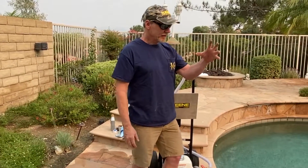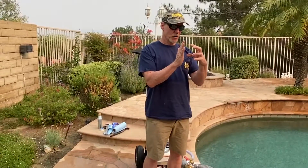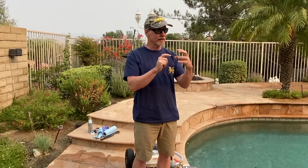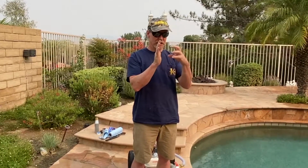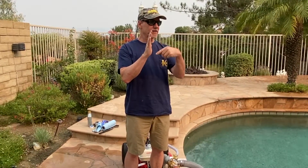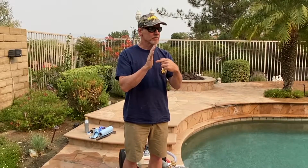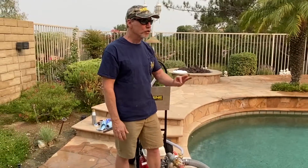See, inside the pump, you've got a back plate and an impeller, right? Well, the seal between the two is called a pump seal, and you have a white, highly polished ceramic surface on the back of the impeller. And in the back plate, you have a carbon-faced friction seal. When the two press together, the water is the lubricant between them. But if that seal starts to fail, you'll actually see water squirting out around the shaft area. You'll know you have a problem.